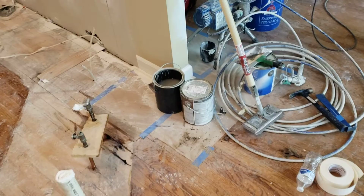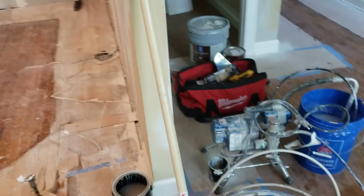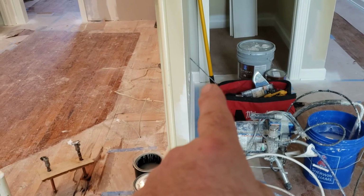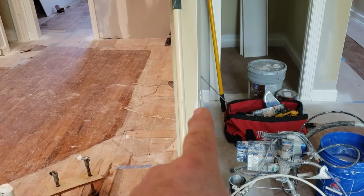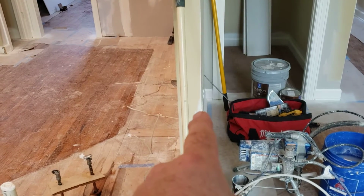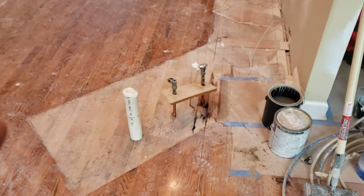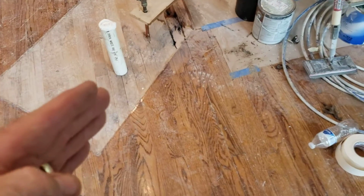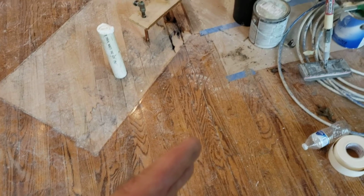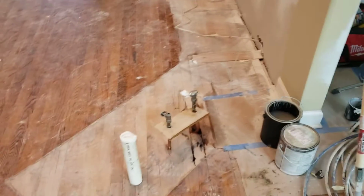In the design I've seen today, the actual cabinets hang past this, which means that your countertop would actually be over here past the outside wall. And the customer said he would much rather have that come up even with the outside corner of that 4.5 inch thick wall. And the only way to do that is to step these cabinets back about 12 inches to make sure that that 12 inches of additional cabinets on the back ends up being inside of that wall line. So I hope that makes sense.